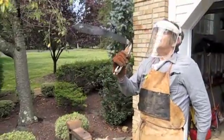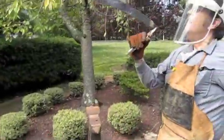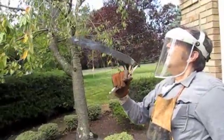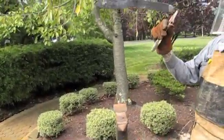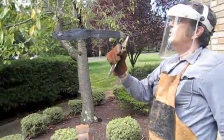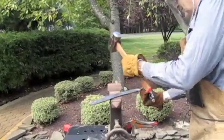Can't hit it too hard because this whole thing is going to collapse, but it is straightening out very, very nicely. And assuming it doesn't twist on cooling, we can now surface grind this, grind the whole blade, and then polish it, heat treat it, and it will do what it was designed to do 2,000 years ago.